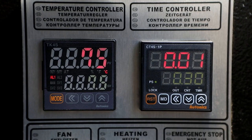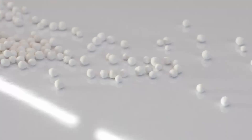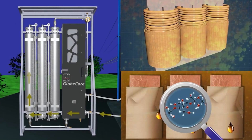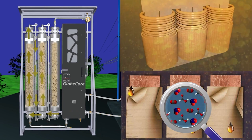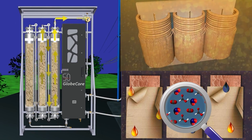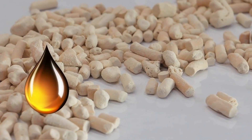When the set temperature is reached, the timer starts counting down the exposure time, after which heating stops. After zeolite is cooled, it can be immediately filled into sorbent cartridges and used for dehydration of industrial oils. This technology can also be used for drying of silica gels, drying and baking of motor windings, and drying of small transformers and electrodes.